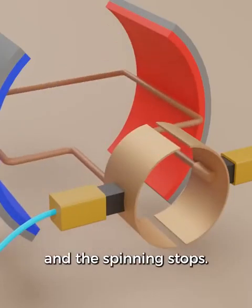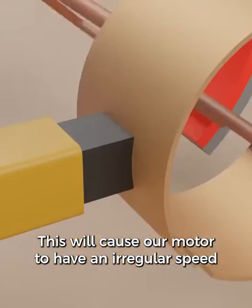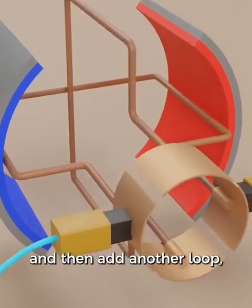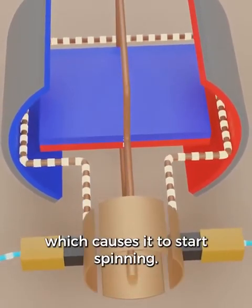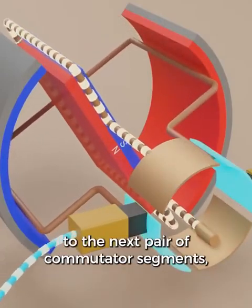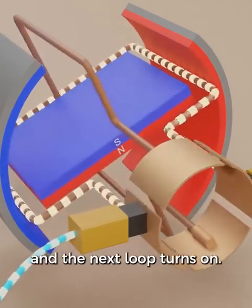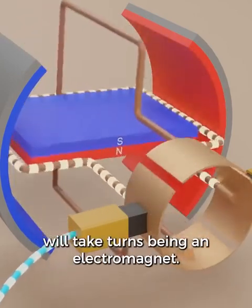Disconnect the battery — no more electromagnet, and the spinning stops. So far we've only used one loop on the armature. This will cause our motor to have an irregular speed, and in fact we could get stuck with the brushes halfway between commutator segments. What we can do is split the commutator ring and then add another loop. The brushes are first in contact with two commutator segments, which turns on one electromagnet and causes it to start spinning. Once we get to the next position, the brushes switch contact to the next pair of commutator segments — this loop turns off and the next loop turns on. This keeps happening as our motor spins; it's almost like the loops will take turns being an electromagnet.